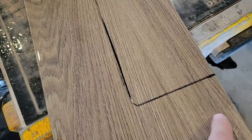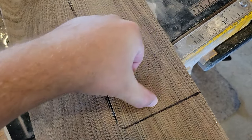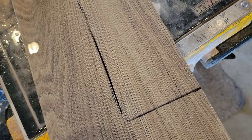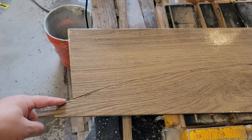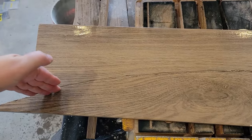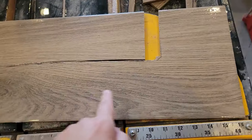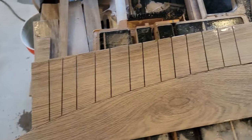Now I'm going to cut the tile on this line, then on another line about half an inch in up to here, and then clear that corner so it looks rounded. I made one cut here and kind of continued making this cut so I broke off that piece. I'm going to make some more cuts here, try to put the blade a little deeper, and break off each piece. I already made a couple of cuts here and eliminated this piece — I cut all these slivers.